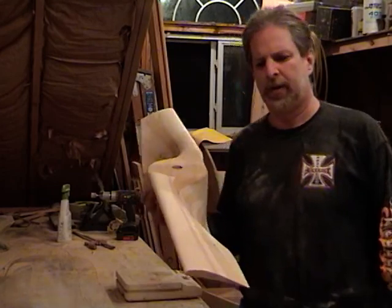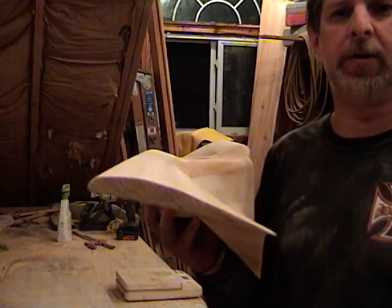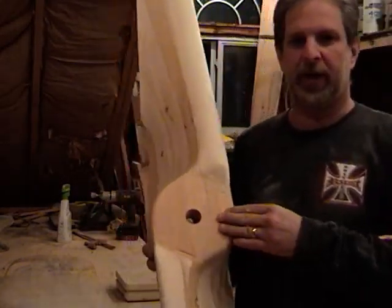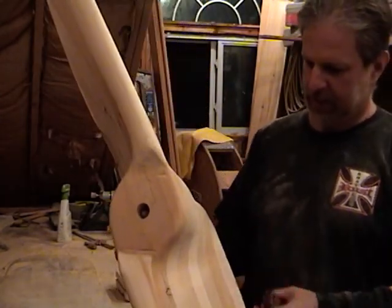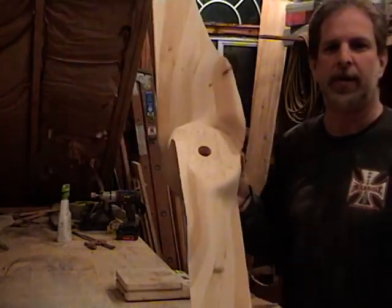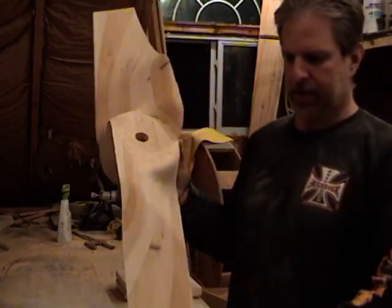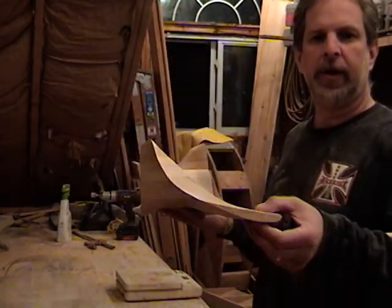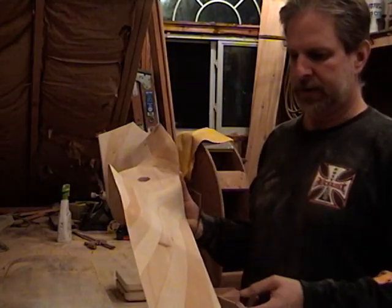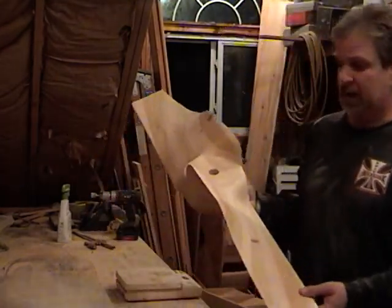I just finished the final sand. I've got the profile all correct now, with my step-up and my chord at the root. I've got seven layers. This prop is pretty much ready for glass work. I'll do a long trailing edge here — I'm kind of liking how it came out, it looks really good. The chord thickness is around seven sixteenths of an inch thick. I've done a bunch of measurements checking thickness from one blade to the next and I think I'm in good shape.